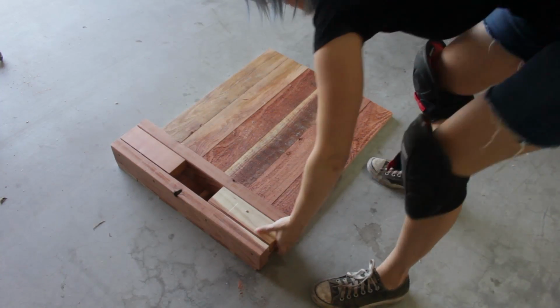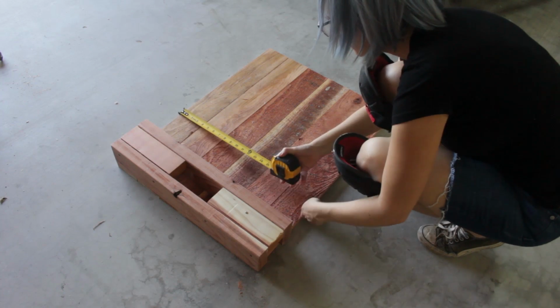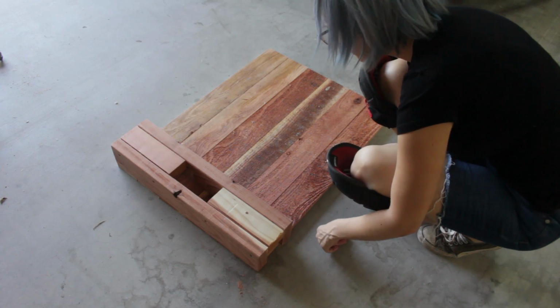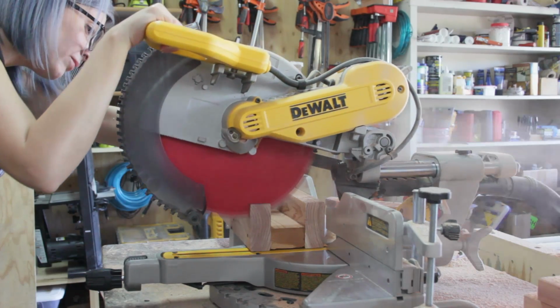When I went to put together my first arm assembly, that's when I realized I made a mistake with the siding. Because I used the wrong size fence pickets, the height of the legs that I created was off. Luckily, I only needed to shave off about 1/2 inch, and so I was able to do so on the miter saw.